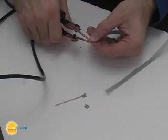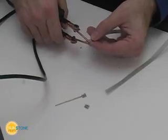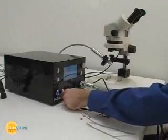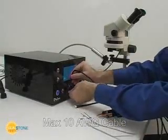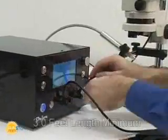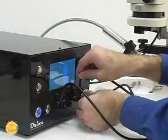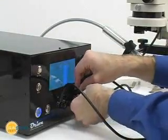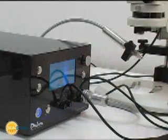Resistance welding can be used to produce permanent or temporary welds as needed. Simply adjust the weld energy to the desired level. It is important that the user only use 10 AWG cable or physically smaller cable such as 12 AWG, and no shorter than 3 feet per welding lead. This will limit the welding current during the spot welding process, which can be thousands of amps, and prevent damage to the Orion.